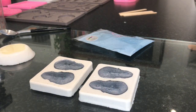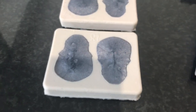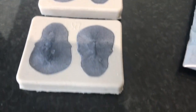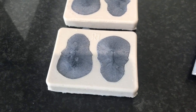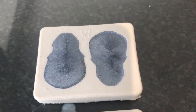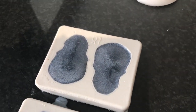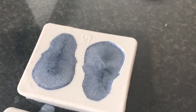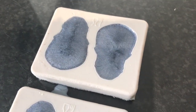So that's now in the mold and again will take 30 minutes. One other thing to remember is the inside of the mold may be textured, so you won't get a smooth glassy finish like you will on the back. The backs are open to the air and will dry smooth and shiny, whereas the front takes on the texture of the silicone rubber inside the mold.